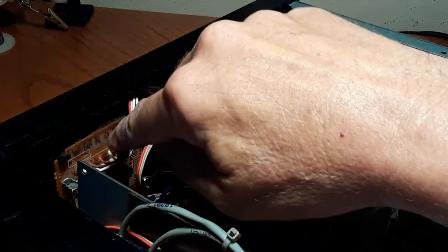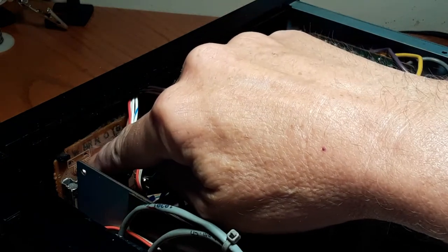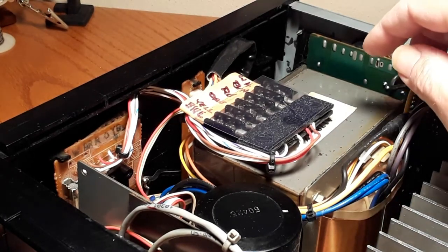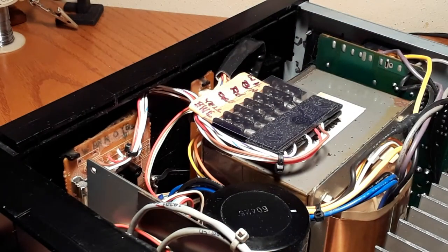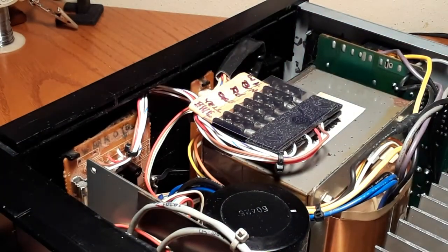So what I did was pull that connector out, put some new Teflon wires on it, ran it into the board, and drilled the hole a little bit larger to get the Teflon in — which I thought was undersized from the start on what Sansui used. Then I pulled the wires down and soldered them as far back the path as I could, so it's not spot soldered in a small area — it's pulled like a quarter to half an inch down the length of the path. Since there isn't technically a mechanical connection, there was just no way I could get barrier strips, and I certainly wasn't going to pull this whole board out.